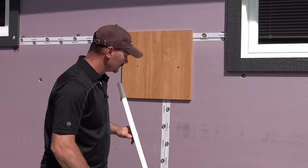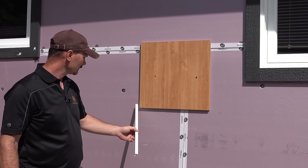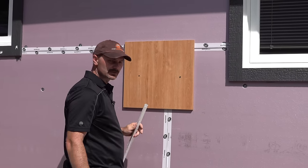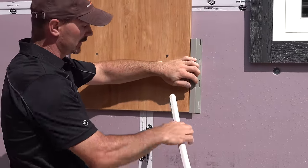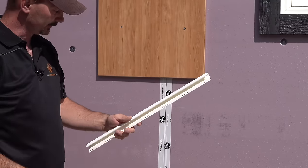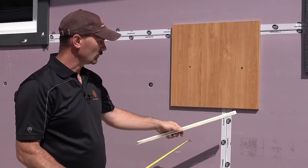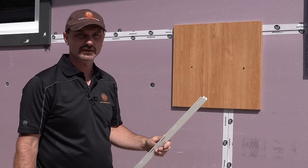One of the first things you're going to want to do when you're ready to start cutting is measure the width of your bottom, right from the outside to outside. You need this measurement plus the width of your channel on each side. If we're using three-quarter-inch channel, you need three quarters extra on each side. In my case I've got 21 inches, so adding three quarters and three quarters — that's another inch and a half — I need to cut this at 22 and a half inches.